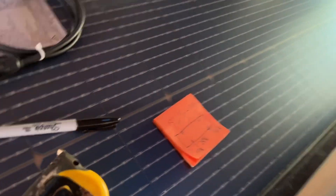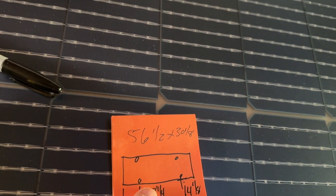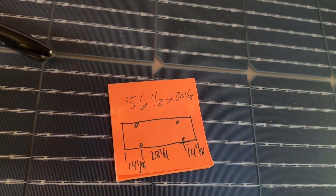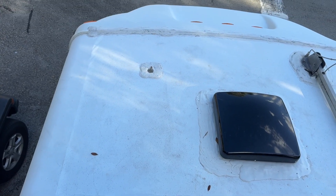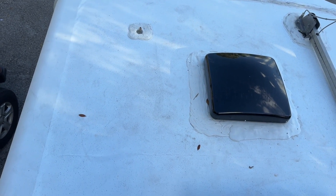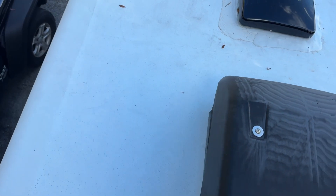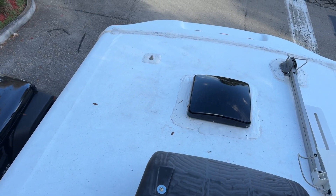I took all my measurements here. Now I'm going to go up on the roof and lay out the actual panels to see exactly where they're going to sit. I'm up here measuring, and those black lines right here — that's where my first panel can go. It actually looks like it's going to be pretty easy; I can just bolt that one right down. I should have three easy panels to put on. The hard panel is going to be this one right here next to the air conditioner — I'm going to have to get creative with that one.